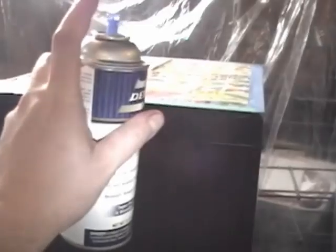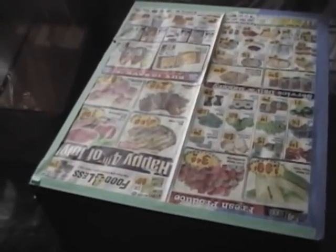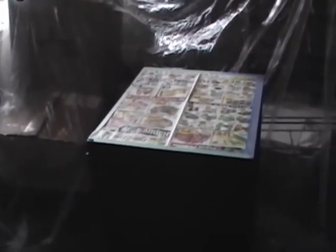Maintain an even distance of about a foot. Start spraying below the cabinet and spray evenly, letting go when you're above it. I also put a sheet of paper over the top to eliminate overspray — otherwise as you come up over the top edge it would leave a light dusting you'd have to sand off. I'll give it about four coats waiting a few minutes between each coat. The fumes are pretty nasty so you should be in a well-ventilated area — I've got an exhaust fan above me blowing the fumes out — and it's a good idea to wear a respirator mask too.